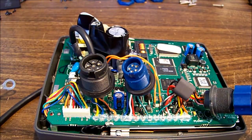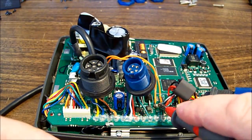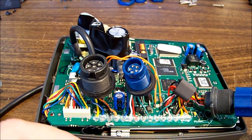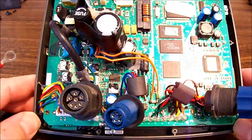What about, let's just take a measurement to that fuse from the positive lead and just see if that is. Ah, it is. Okay, so this seems to be our main fuse in, and while the book says use an external 3 amp fuse, the internal one's only 2 amps. So if you ever get to the point of blowing the external one, the internal one's probably already gone and then you have to send it in for service anyway. Unless of course the internal one is some kind of slow blowing fuse so that the external one can be used. However,